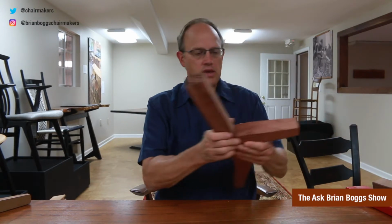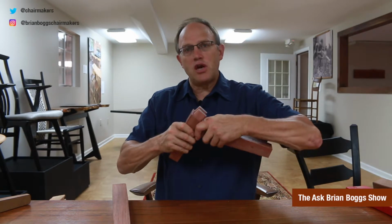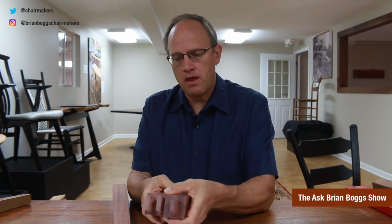What is new, I think, I just haven't seen anyone using tapered tenons like these. These two tenons, each, I don't know if you can see it there, the tenons actually taper 3 degrees so that over their 1.25 inch length, they taper 1/8 of an inch. And that's just done with standard mortising and tenoning techniques, but using a custom bit with a 3-degree taper.